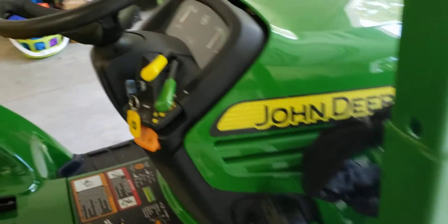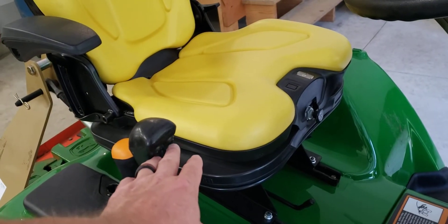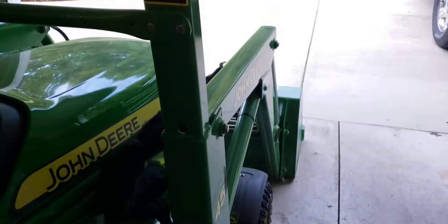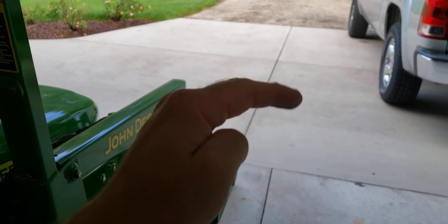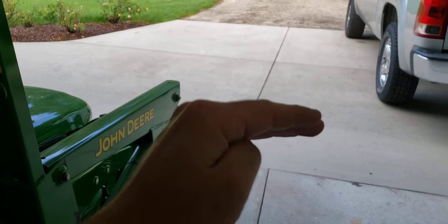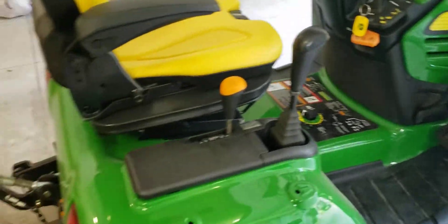What I also did with my joystick is put two buttons on it for my snowblower, along with some relays underneath the dash. Those buttons control an electric actuator on the back of the snowblower that will raise and lower the spout, so I can direct the snow really far, really close to the blower, or anywhere in between.